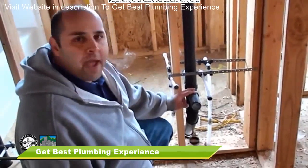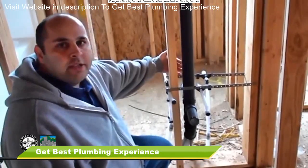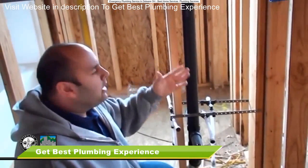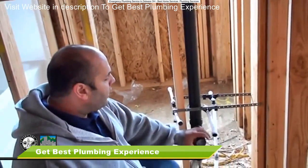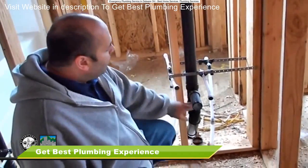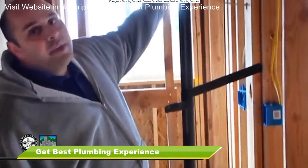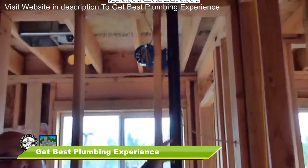And this one actually is a back-to-back situation. So this ties into the one directly behind it. So we have a back-to-back bathroom. And this bathroom, this is our drain. Here's our supplies. When we get to the other side, we'll show you the other side of that. But they come together right here, and then this creates its own vent going up and then ties into that vent system.